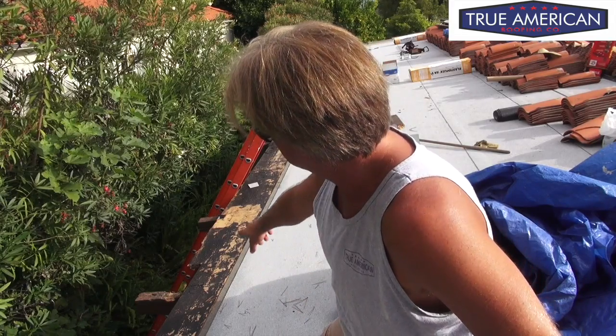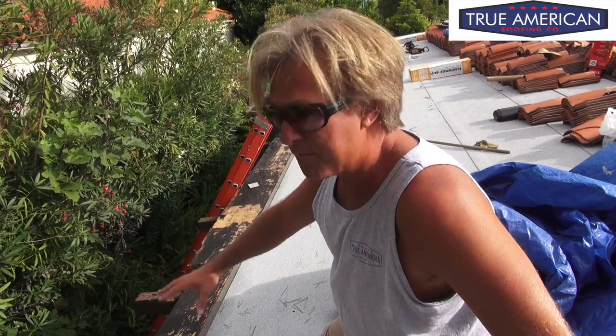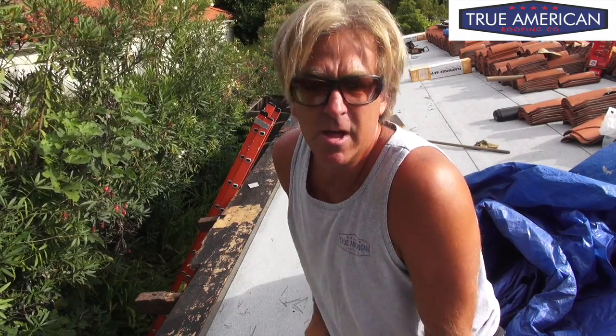So what was happening is that we have pockets of a lot of damage and pockets where there's no damage. After discussing it with the homeowner, we decided the best thing is to give them a really great flat rate and just tear off all the fascia and the first board, because we have pockets where everything's perfect, and then bits and pieces where you've got rot, good, rot, good, rot, good, and it's too hard to cut and splice.